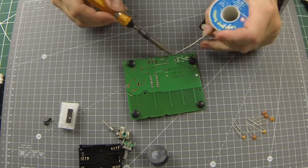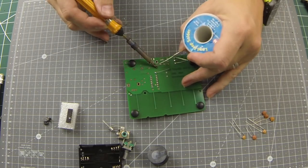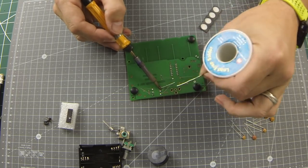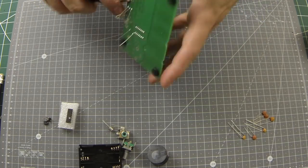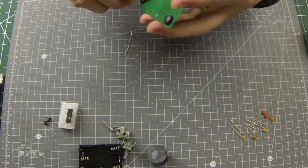When it comes to soldering, these passive components are quite forgiving with the application of heat and, of course, can be oriented either way round. Check each solder joint as you go, using good lighting, and if you have older eyes like me, a magnifying glass. Clip off the excess wire with small side cutters.